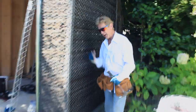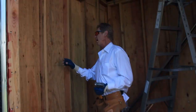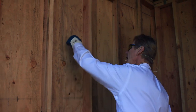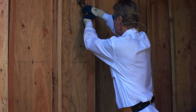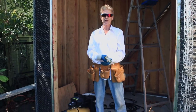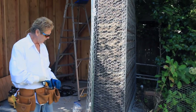About thirty to thirty-five years ago, we did a house in Tiburon and got gung-ho with staples. The inspector came out and said flatten them all down. Flattening them gives a better bind, and if you pull them out you create a lot of holes. So don't replace the lath and don't pull the staple — just before you do the installation, flatten them out.